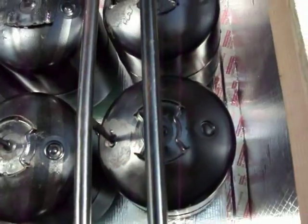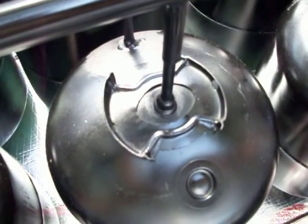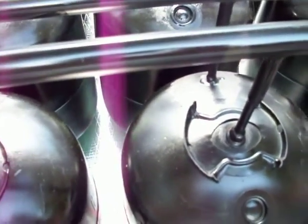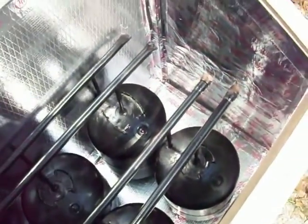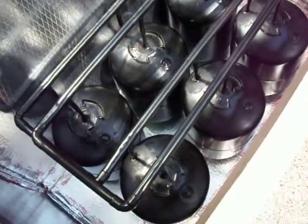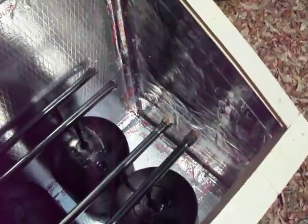The tubing comes out of the top of each drum. I cut all the handles and valves off with a grinder and brazed the tubing into place. I've pressure tested this to about 400 psi with no leaks. I was a little concerned about the pop-offs on the tanks — I found out they're rated to blow at around 410 psi, so I was pushing it without realizing it. That's a safety feature built into the tanks, and under normal operation it should never reach that pressure.